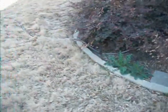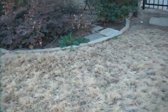There's a grading inspection of the rear yard. Now this area here has got the nice ornamental stonework in it. What you've got to make sure is it doesn't trap water and that there is a way for the water to flow out. Otherwise it's going to cause pooling next to the foundation, which can cause hydrostatic pressure to rise, and again that will affect the foundation. Yeah, this area is sloping away from the building, so we should get good drainage.